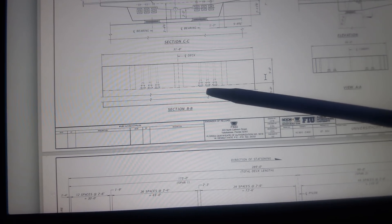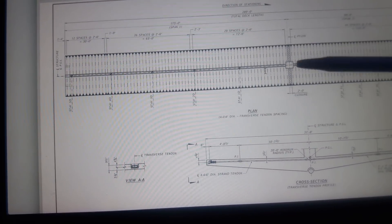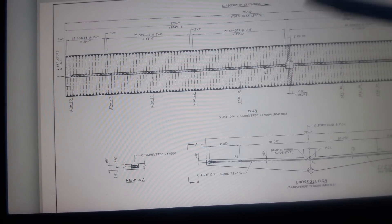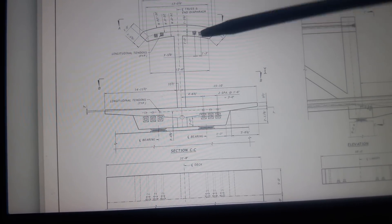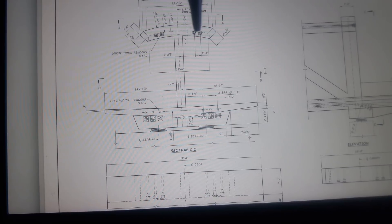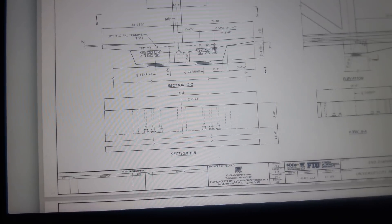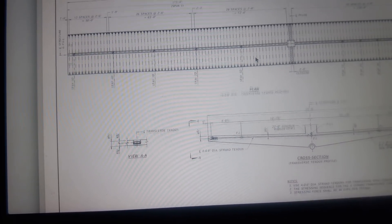The top canopy has one, two, three tendons — three at six — and then what they refer to as transverse tendons going this way, giving tension that way. In the arch I don't see them in a straight line. These deck tendons are tensioned first, then these other guys are tensioned, and now it creates a sheet of tension every two foot six inches.